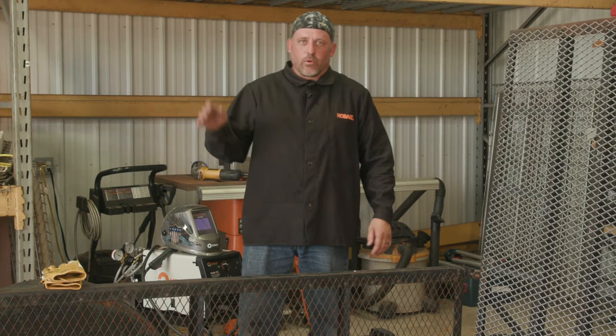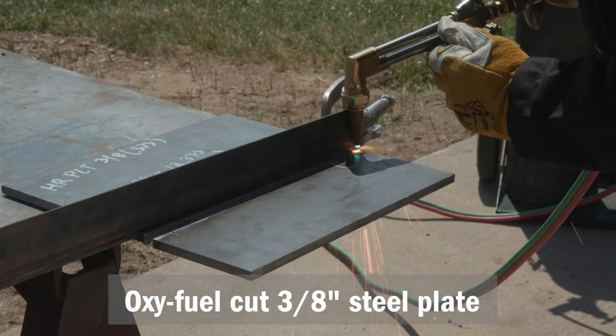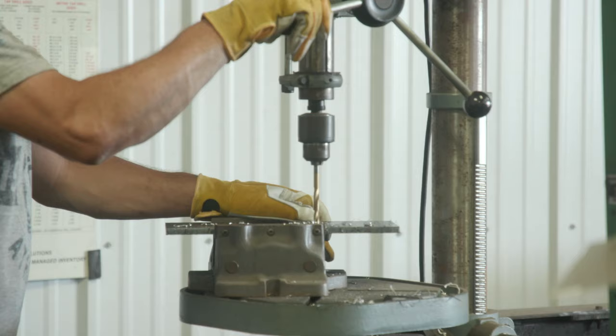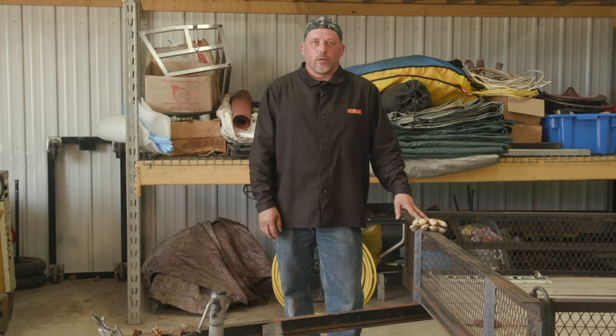The bracing is on, so now it's time to move on to the next step of the project. We're going to move that spare tire holder to the back of the trailer here. What I need to do is cut a piece of plate for that, drill some holes in it that match the spare tire holder where it's bolted on, and then we'll get that mounted back here.